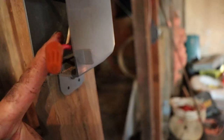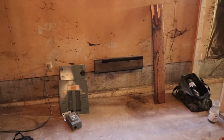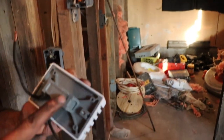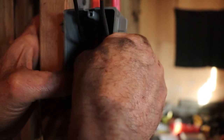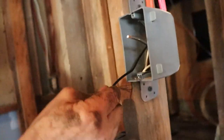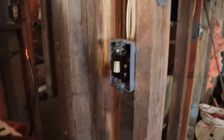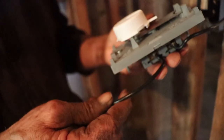Once you do it, just make sure this guy is really tight. As you can see, this is a hot wire too — this one goes straight to the old heater in there, which we're gonna replace in the future. For now it's still working good. I'm gonna connect this one and push it back. As you can see, I don't have a place here for the ground wire, so it's just two wires coming out from the thermostat. I'm gonna push this guy right back. This one is bringing the power, and this one is going to the heater. I'm gonna cut this guy a little bit short.